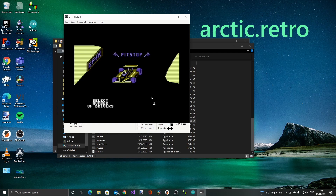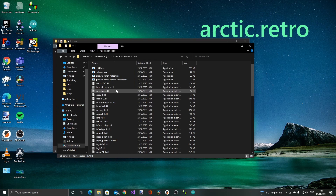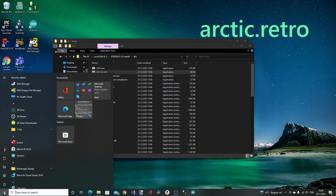We can't actually take this CRT file and burn it directly to the EEPROM because that won't work. We need to convert it into a binary file. For that you can actually use one of the programs within VICE — if you go to the bin folder for the VICE installation, you'll see there's a cartconv.exe, and that's the one we need to use to convert.